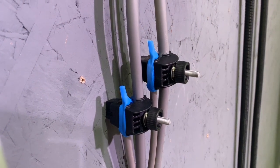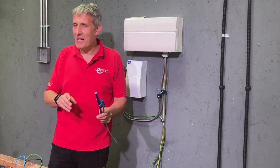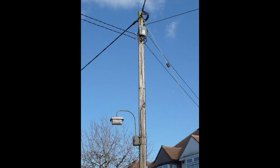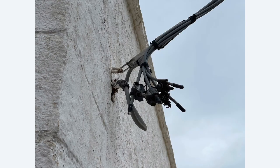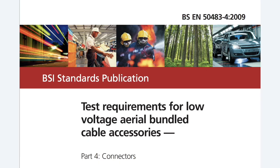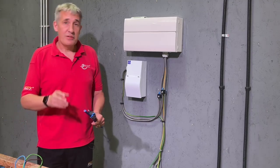Just a little bit of background about these. They are a well-established technology — they even have their own standard — but you usually find them in what's called an ABC, or aerial bundled cable. Normally you'd see these at the top of electricity poles, particularly in rural areas where they're distributing power overhead, used to tap into the bundled cable, possibly to feed down into a property or tap off for something like a streetlight. The individual cables are wrapped around each other, insulated with an additional protective sheath on the outer. They can be aluminium or copper, and they have an extensive set of standards and are used extensively in that industry.